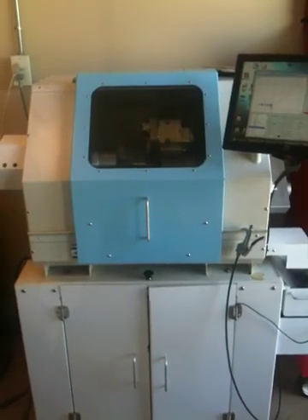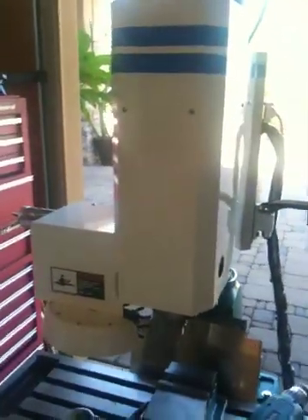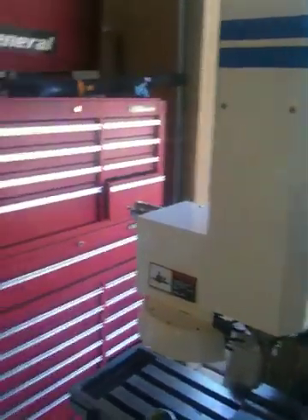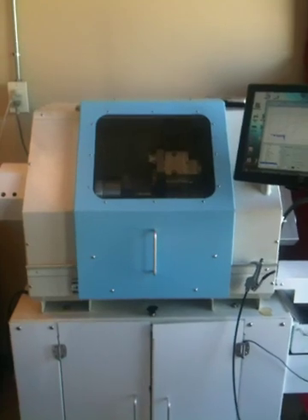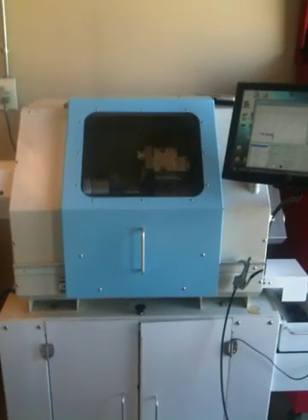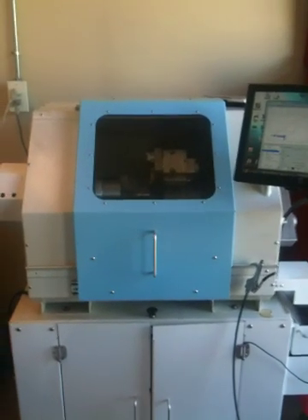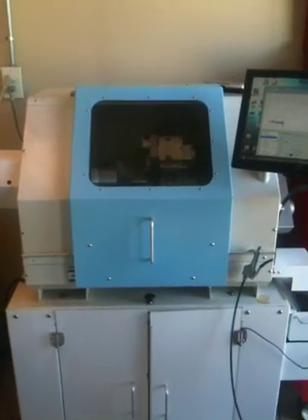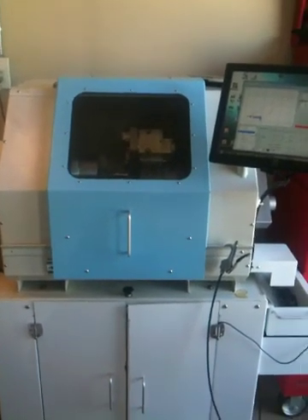I'm still making machinery. I have a video showing a little CNC mill with an automatic tool changer on YouTube. Now I'm putting together this video for this small CNC lathe. It has an 8-tool servo turret that is bi-directional — just program an M6 T-number and it pulls up your tool.